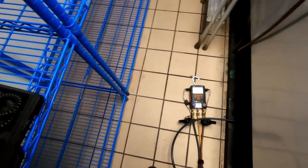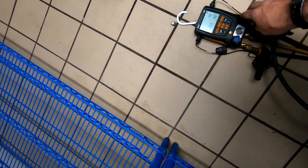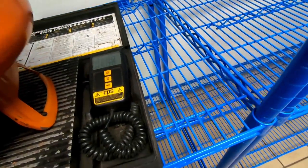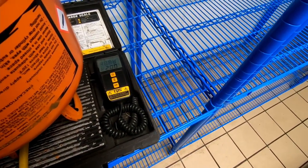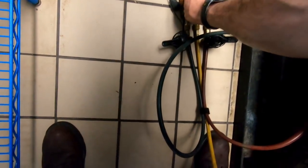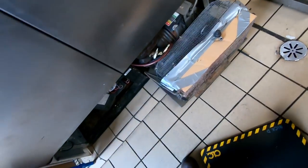Let's get this thing juiced and see what we pick up - the vacuum didn't impress me much. Went off quick: 17, 18, one more ounce - there we go. Let's see how bad our head pressure is. I really need to get that coil cleaned off - it's kind of a wreck. The store's not open yet, they're getting ready for the season, so we've got the place to ourselves without people in the way.